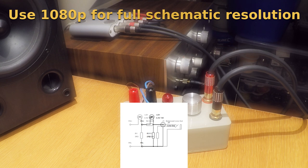The circuit shown below uses what's called impedance balancing, where, although the audio signal is only connected to the hot side, an almost identical impedance, in this case 220 ohms, referenced directly to the signal source's ground, is connected to the cold side. This allows a balanced input to reject common mode interference, such as ground loops and electrostatic coupling, which will present themselves equally on the electrically identical hot and cold sides.